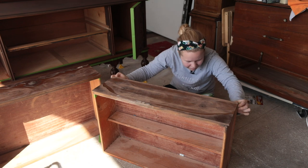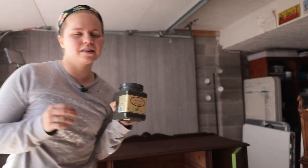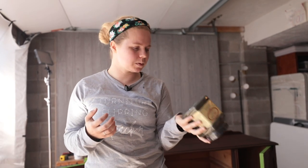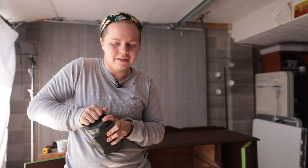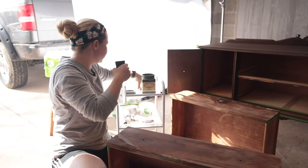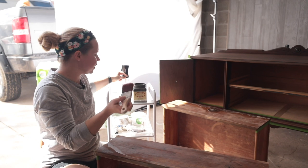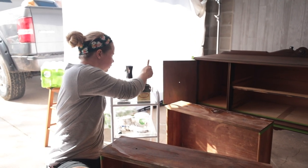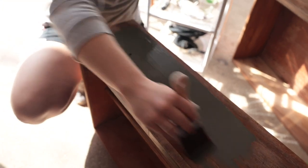I don't know if I've told you yet, but I'm going to be painting it green — Collard Greens by Dixie Belle. It's kind of a dark, deep green, but more of a grayish green. I'm excited to open it up and see what it looks like. I'm not going to do any priming because this is a darker color, so there shouldn't be any bleed-through. I'm just going to wet my surface, put a little bit of water in the paint and on my brush. We're doing this to smooth out and thin the paint a bit — it's pretty thick chalk paint, so doing that will allow your brush and paint to glide better over the surface and also helps eliminate brush strokes.